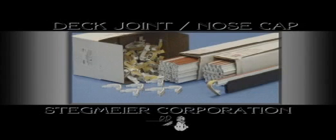Stegmeier Corporation's deck joints are an extruded PVC control joint that is used to plan the cracks in the pool decks. They are placed in the concrete while the concrete is fresh and provide a weakened plane.